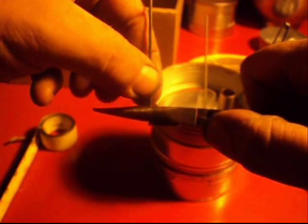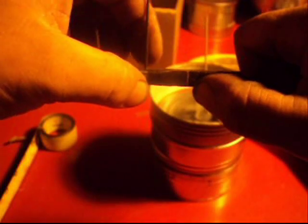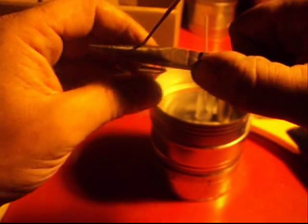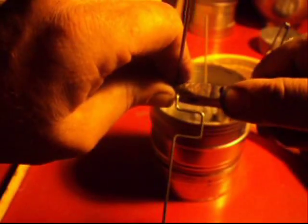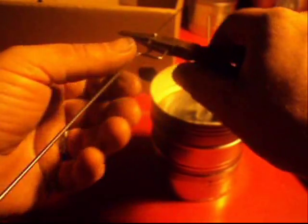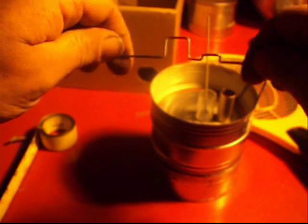Hello, I'm Scott Brown with Green Wind and Other Home Energies. I've decided on three-eighths of an inch for a three-quarter-inch stroke, and that seems to be the width of my pliers. Slide the pliers down to the bend, line everything up, and bend straight toward me with all the pressure right here. That's three-eighths of an inch for the width of the crank lobe. One more bend in the opposite direction — 90 degrees out of phase — and she ought to spin nicely. That'll do right there.